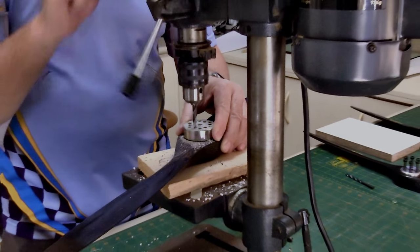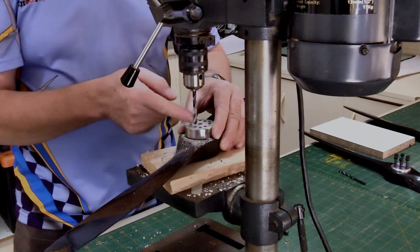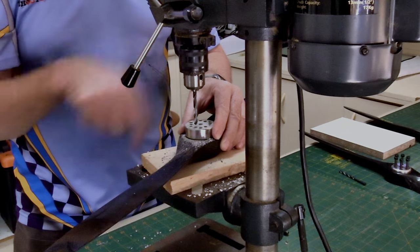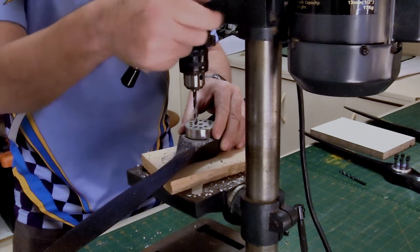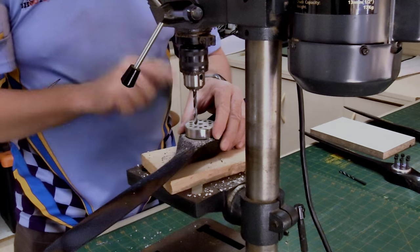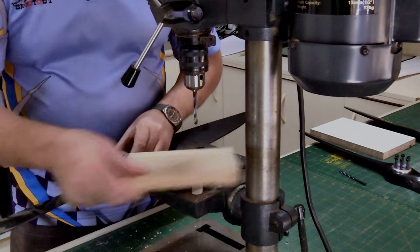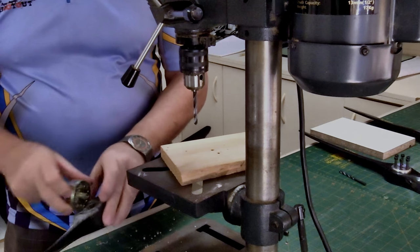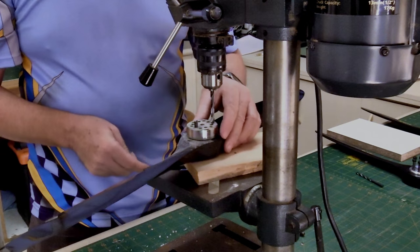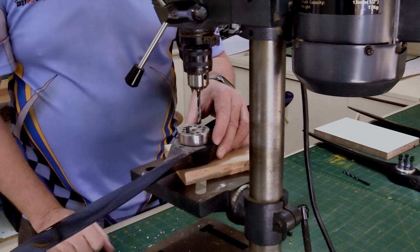You'll notice that I'm going in and back out quite often — the whole idea of that is so the flutes in the drill bit don't get blocked up with chunks of carbon and epoxy or timber. These all get jammed up and will cause the drill bit to track off even more, so just go in little bits at a time, let the drill do the work, don't force it, and come back out again. When you've done all of this, clean this part off because you'll see lots of remnants hanging around — just tap on your bench so when you go back on again it's nice and flat. This is where we use our little pegs — it drops straight into the hole. We'll drill a secondary hole all the way through, then these four other ones only part way through.